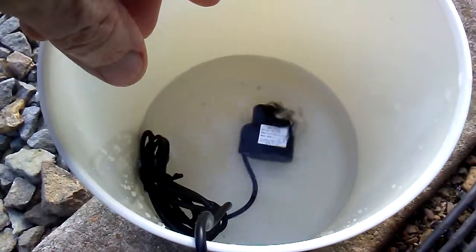That's one way to slow down the water — one of the ice-water air conditioner tweaks you can do. You can watch some of the other videos where I go through different designs. When you reduce the specs and make a mini split out of it, you don't need a big ice chest or a big radiator, as long as the heater core is big enough that the fan can pull cold temperature off the aluminum fins and blow it into a small room like an 8×10 or 8×12.